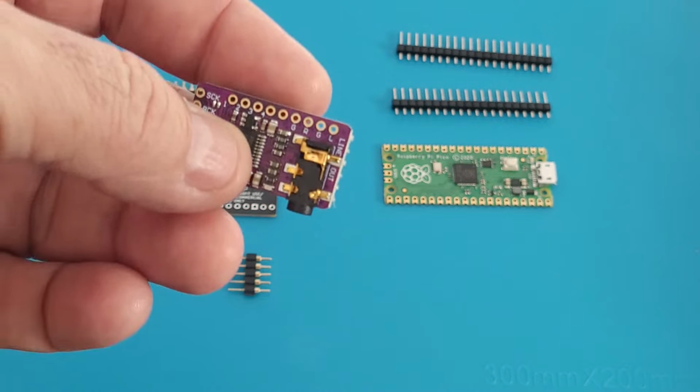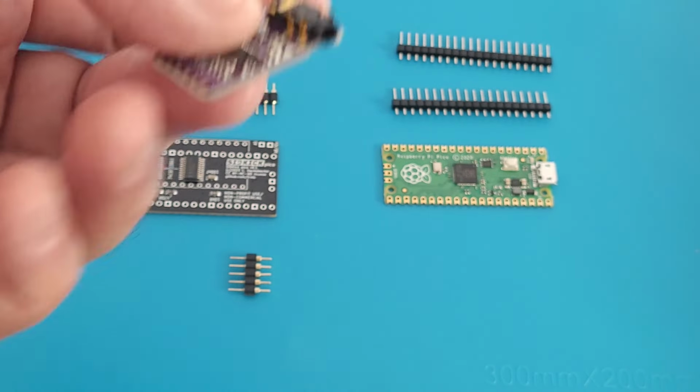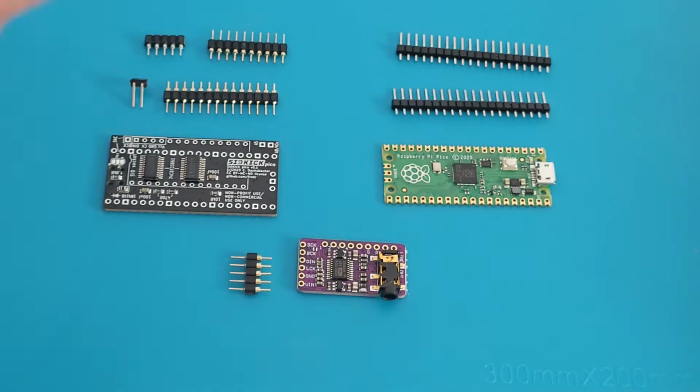But you can also hardwire your stereo. You can wire this to pin 7 of your AV port. Pin 7 gives you the second sound channel if you wanted that. So there's a lot of stuff that you get out of this that's really, really cool and cost effective. For the whole kit and caboodle here, we're talking about $15.